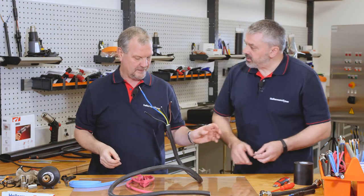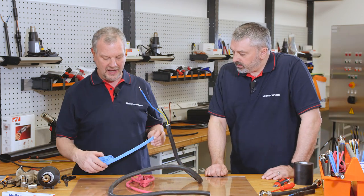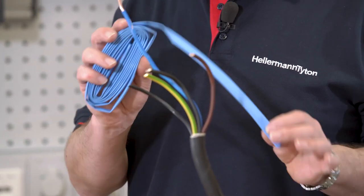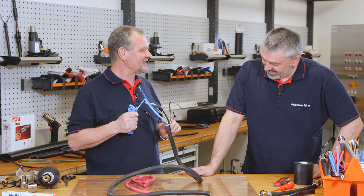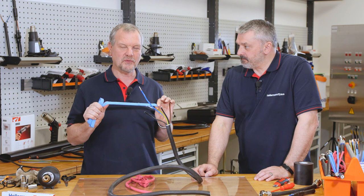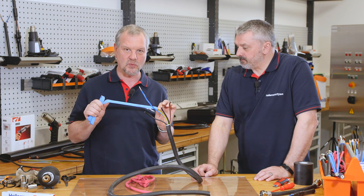We also need to check the rating of the cable. We know the rating of this cable, and our TF21 is rated at 600 volts. So this is a perfect application for repairing this cable sleeve. Our OD is 5.6 and our tubing will shrink down to 4.8 — it's a 9.5 that shrinks down to 4.8. It's called a 2 to 1.